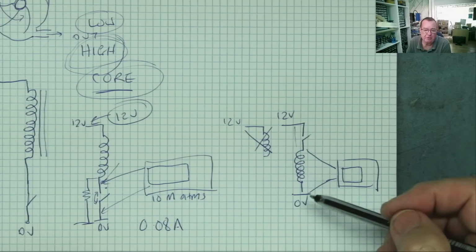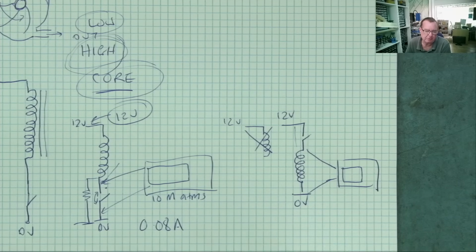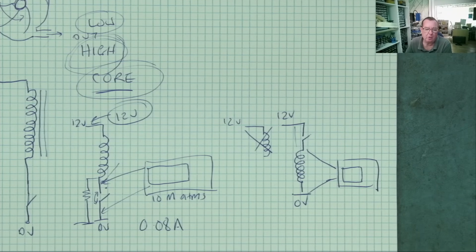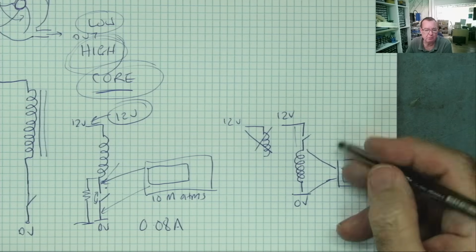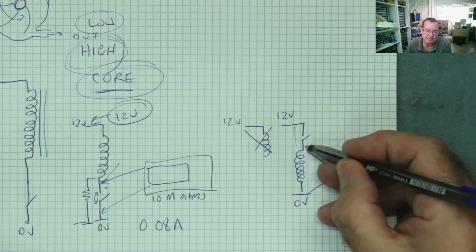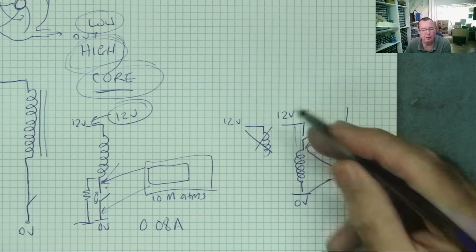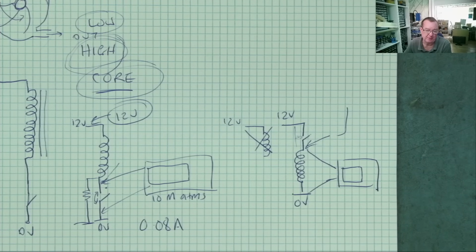So you've just seen we got even more voltage across here. Before was about 510 and now it's like 590 practically. We get more voltage across here. Why? Because there's no longer a current path through our oscilloscope. The current's got to go somewhere, yeah. And basically the voltage at this point will increase to a sufficient point to form a current path. That was the breakdown of the air in between. So we would actually get bigger sparks if we could see them very well. And we got a higher voltage there.